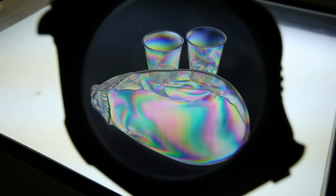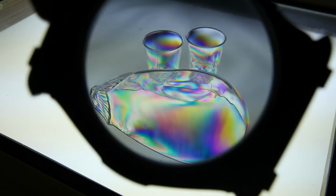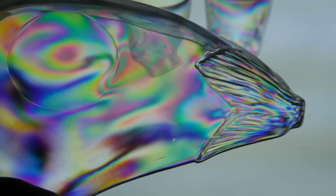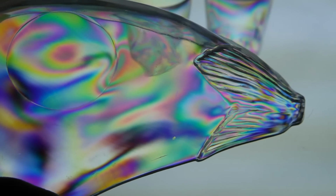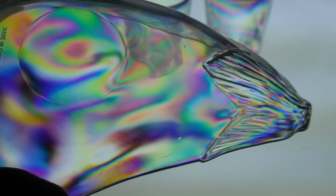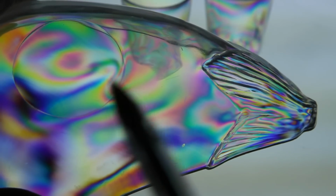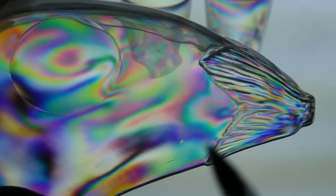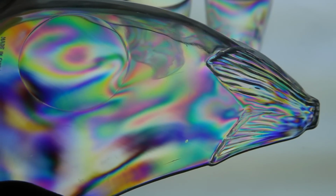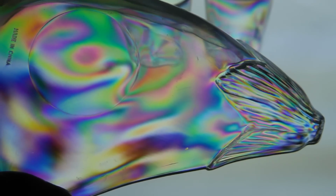Now, the different patterns that show up in Birefringence are used in industry because they show up the stress patterns in an object. Birefringence has been used in industry to detect stress areas in objects. So if you make a model of an object, let's say a machine part, in acrylic, you can see the stress patterns in that model, and you can see where the areas of color are close together, like here and here and here. They're areas of high stress. So that's where the object is likely to break in use, and so modelers can redesign objects to make them stronger and less likely to fail.